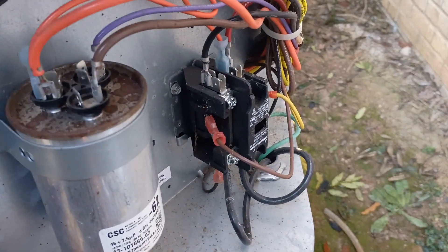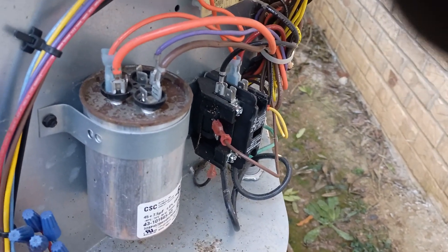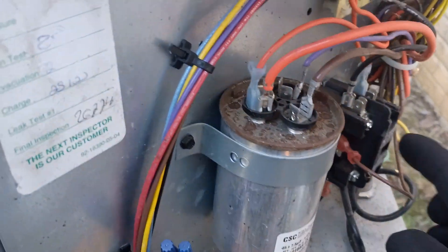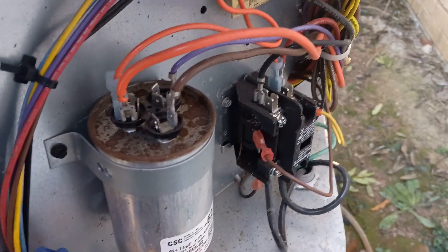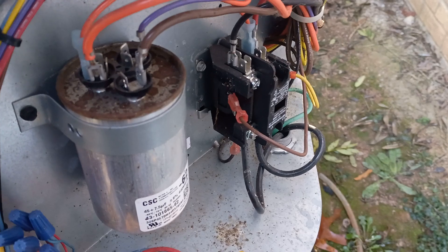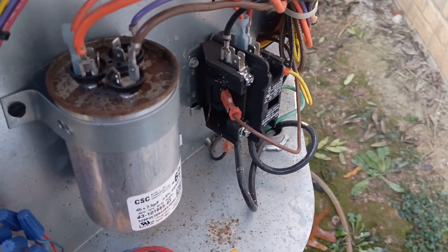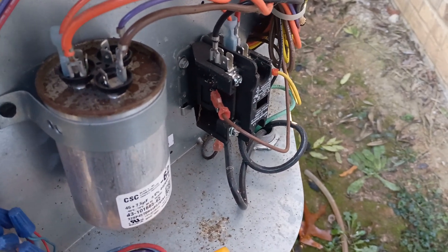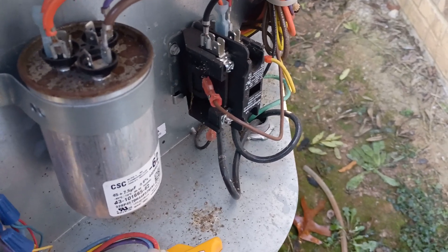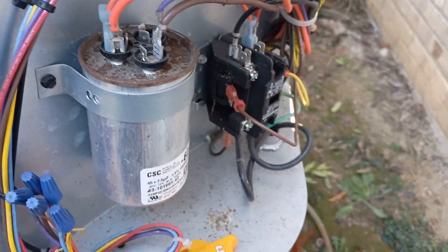Apparently that only happens when you test it. If this thing was to go into a defrost on its own without me hitting the test pins, apparently the contactor stays broken a little bit longer - because that's the issue we're discussing. When that contactor breaks, it's breaking for a reason. It's going to break for roughly eight to ten seconds, giving the refrigerant time to equalize so when the compressor shifts it's easier on it and quieter. That's the kind of stuff homeowners don't like. It defeats the purpose of breaking the contactor if you do it that quick.